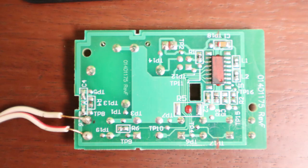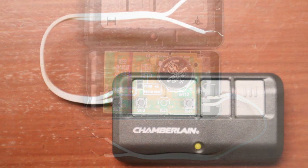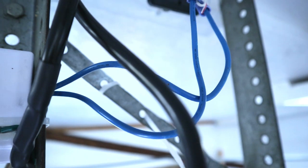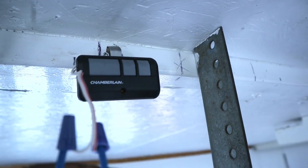After a little research I stumbled across a video which demonstrated how to automate a garage door opener by wiring a smart relay directly to the circuit board within the garage door remote. So I decided to test this method by wiring my Go Control relay to my Chamberlain remote. Using this method, I now have the ability to control my Chamberlain opener within the SmartThings application.